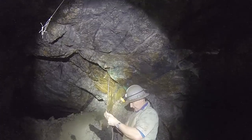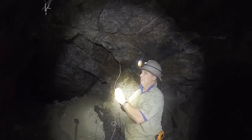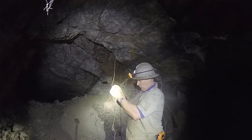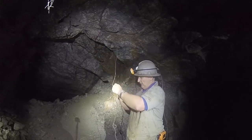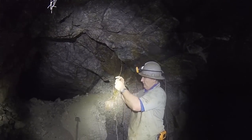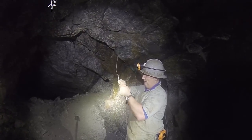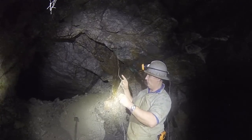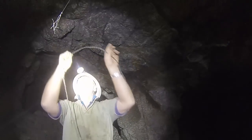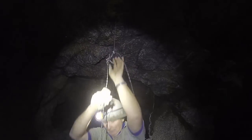And then what we'll do, we connect on. We've got a copper wire in this, and our firing cable here. That's connected. What you must check, and you have to do it when you use electric dets as well, is that these don't touch, because you get a short circuit. So what I'll do here, just twist that there, that's out the way, and that there. And we know full well that those two ends aren't going to touch and give us a short circuit. Just keep this up out the way. Tiny little bit of string there. And then we'll lay the firing cable out.